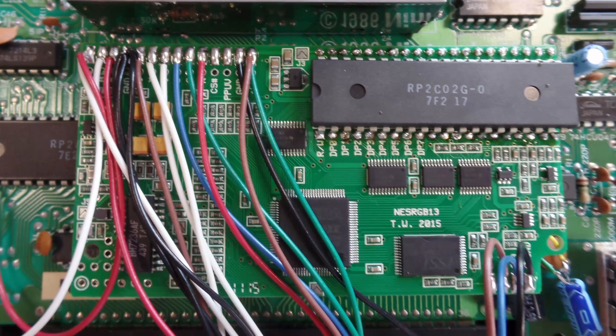The solder sucker pump works best when you're desoldering a large chip with about 20 to 40 different pins all located right next to each other, so you can rapid-fire through them. It won't remove all of the solder perfectly, but it'll get a big chunk off in a short period of time. You have to learn how to work with that tool specifically.